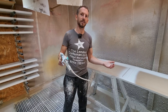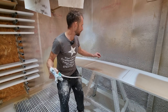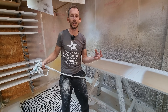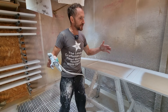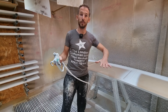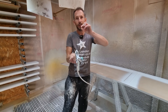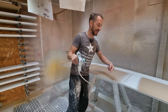Three coats is generally sufficient for us to close those gaps up. Sometimes after two you see little hairline gaps and you think, am I going to cover that on my last coat? But it's all about how you make your doors. When we glue these down, we generally just use PVA on the strips, pin them down, move them around so the glue isn't lifting the work piece up too high and creating a gap. We don't want to get the squidge out because that's a bugger to clean up after.